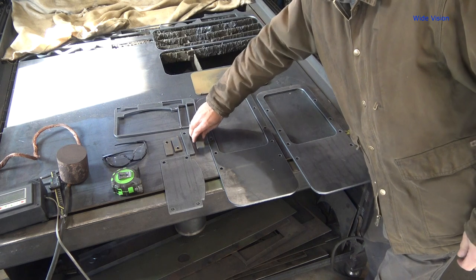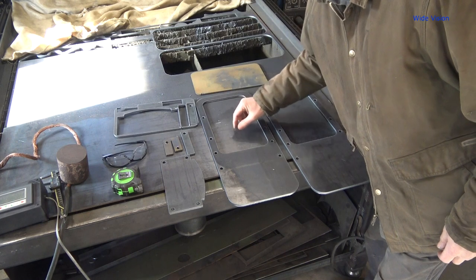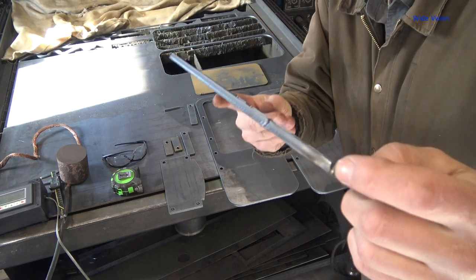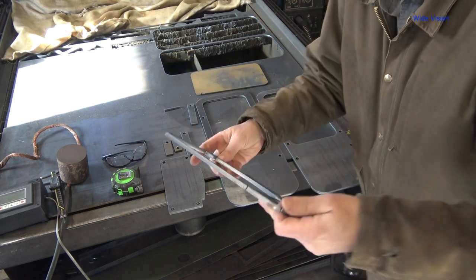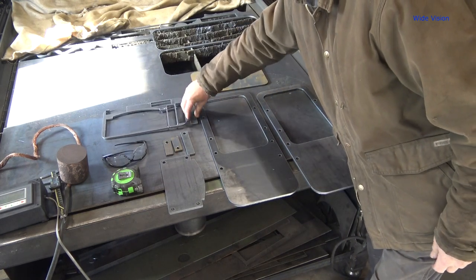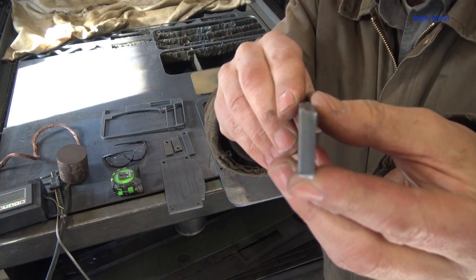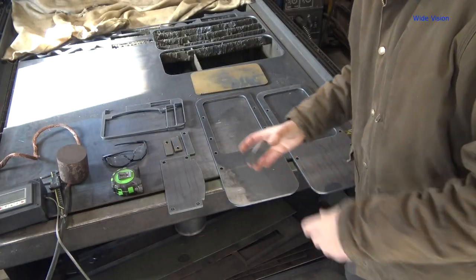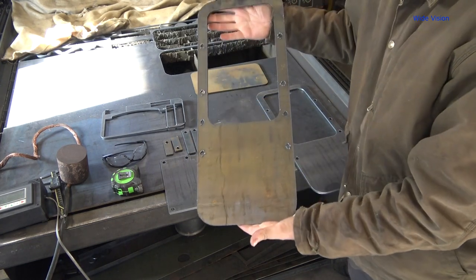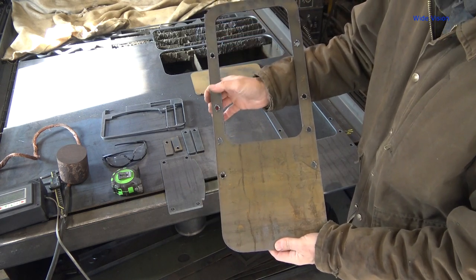With my new changes to the toolpath, when I cut out one of these bars out of the top piece, I actually cut through and got a little too close to that edge — I thought there was more than enough room, but not quite. It just barely nicked the corner. I'll move it over just a bit and it'll be fine. Very little dross on the back side of these parts. The holes have a lot more dross just because you cut slower — the slower you travel, the more dross you get.